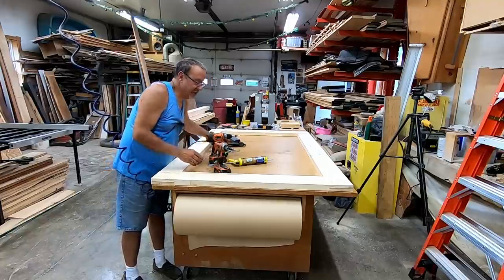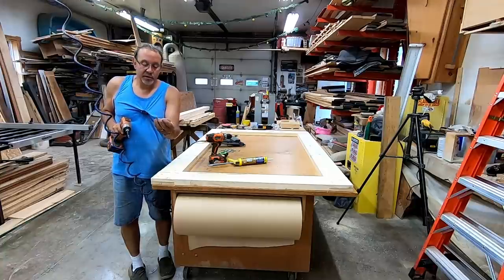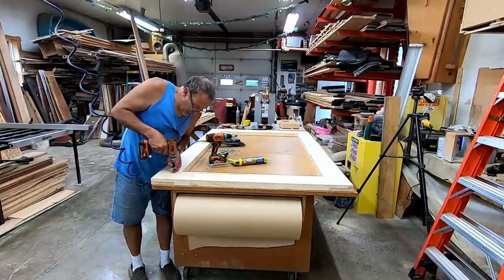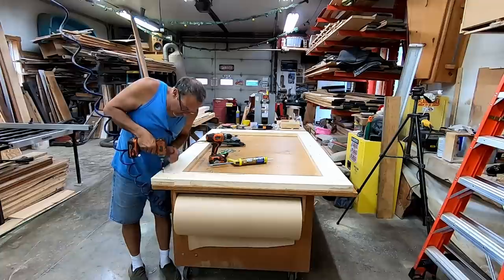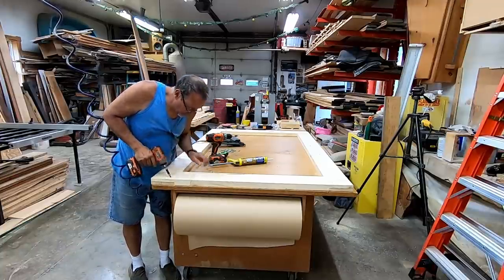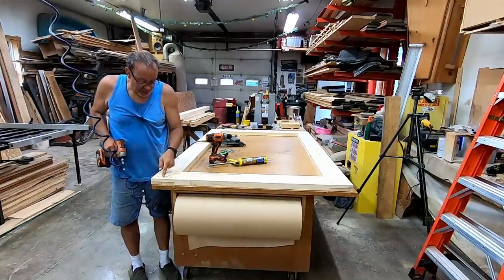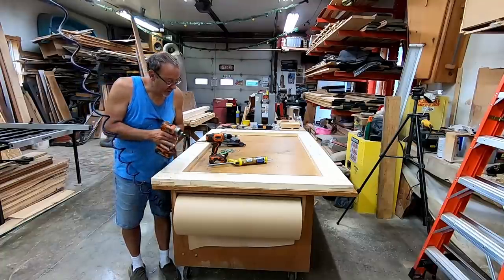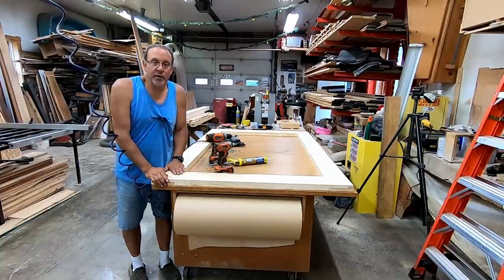And we're gonna put hinge screws in it. Being a carpenter, I find a lot of these screws, we just throw them away when we're using metal doors. So these are like a number 14 screw, and they're very heavy duty. So we'll go around and do the corners all the same, and then we'll flip it over and put a different pattern, maybe two across the opposite, so that way you're pulling from both sides. So we'll go ahead and put this together, and then we'll be ready to put the OSB on it. I'll be with you here in a minute.